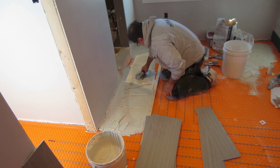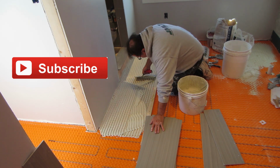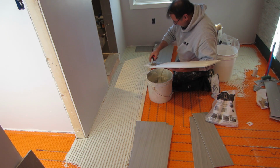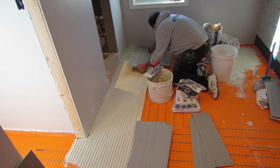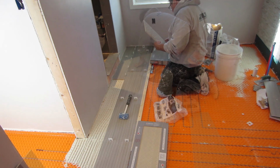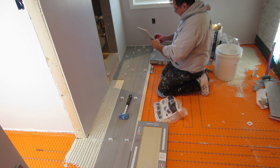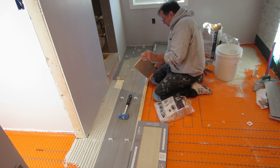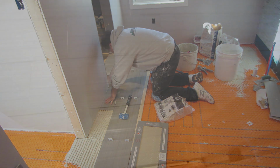Okay, so Schluter requires that the wires be tested 3 times. Once when it's still on the spool, before you insert it into the mat, once when the wire has been inserted into the mat, and once after the tile has been installed. Schluter used to require that the wire be tested both with the multimeter and the mega ohm meter, and now they only require the testing with the multimeter, but if you do test it with the mega ohm meter, you'll get additional years of warranty